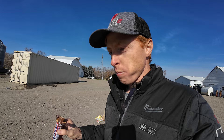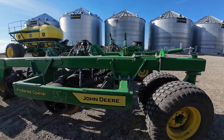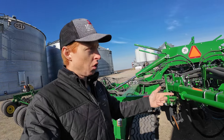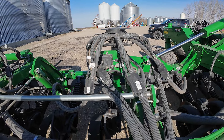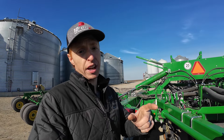Another thing that satisfies is Ready doing your air seeder — the satisfaction in that being done efficiently, accurately, quickly, with excellent parts. We're here in Osnabrock, North Dakota. We're looking at an N560, 60-footer, 10-inch space machine, 550-bushel cart. He's looking at having us do the disc hose — the primary hose — which is having some leaking going on from wear, springing some holes or leaks. We also talked about the sensors, which are pulling out of the hoses sometimes from the force or tension or shaking. Those sensors don't clamp the best on this urethane or PVC hose, and we've got a fix for that.